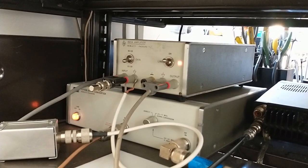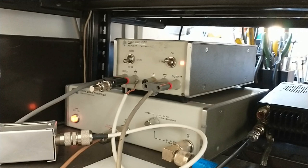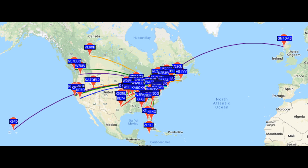The 630 meter signal that leaves the low pass filter goes to this HP instrumentation amplifier to be amplified by 20 dB. That 17 dBm signal then goes through about 150 feet of coaxial cable to the non-directional beacon amplifier. The non-directional beacon transmitter increases this signal up to 25 watts, but with the electrically short antennas mandated by the FCC, only about 350 milliwatts gets radiated by the antenna. Even so, the efficient digital encoding provided by modes like FST4 and JT9 allow for communication over long distances.